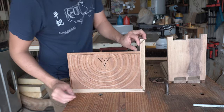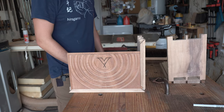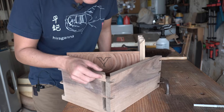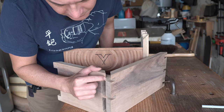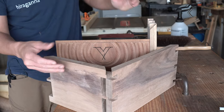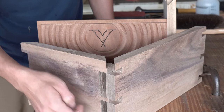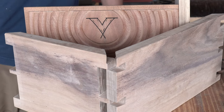So you can see here that I'm probably at least an inch off. I don't know what happened. I haven't the slightest idea. However, I have this corner over here. This corner I mucked up with the chisel and my jig and ended up taking off a lot of material over here, too much, and it was going to be a fix anyway. So, based on how dovetails work and the fact that these will essentially slide in here, I think I can drop my marks all down and cut it essentially about an inch off and make sure that it fits absolutely perfectly.